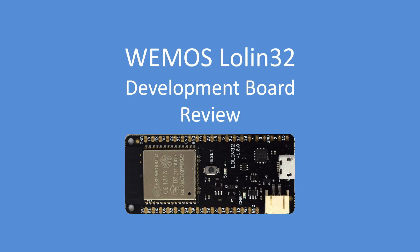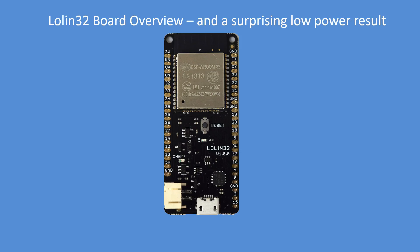Here's a quick overview of the board itself. It's FCC certified. A good thing about this board is it has plenty of ground connections, so if you're into development and want to make sensor connections, plenty of grounds which is extremely useful. There's the 5 volt VIN from the USB, 3 volts at numerous places around the board — again exceptionally useful. Also grouped together, which I like, is the clock, master out slave in, and master in slave out for the SPI bus, and the hardware serial port 16/17, and the programming port transmit/receive.